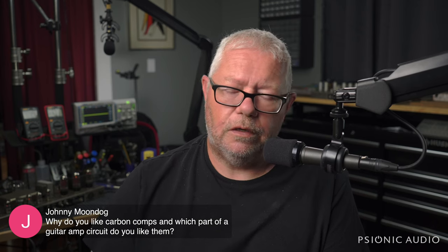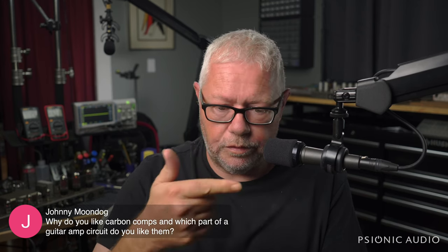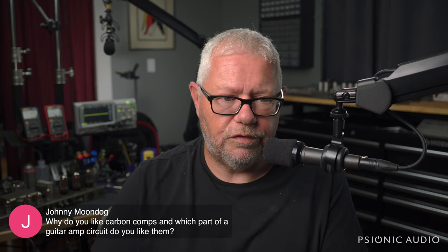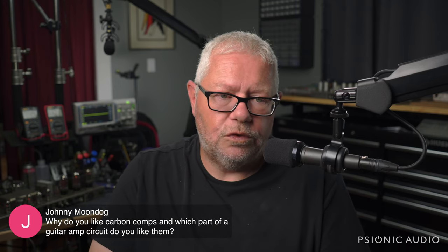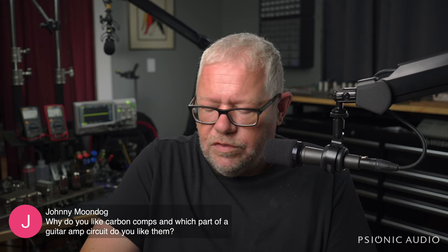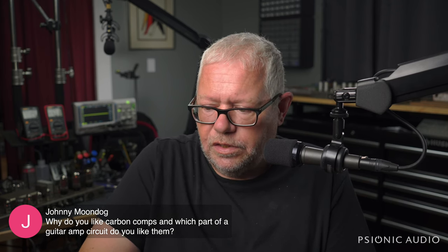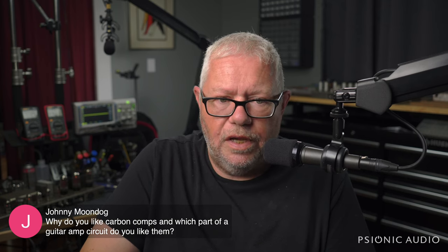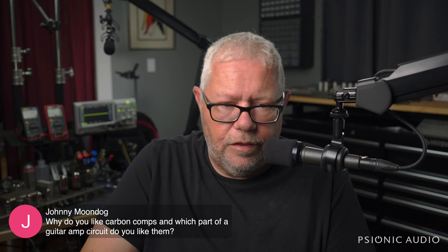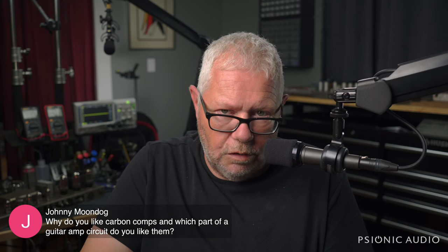It's a particular sound, and there are trade-offs to everything. I've answered this at length in other live streams, and I've addressed this in individual vintage Fender repair videos. As to which part of the circuit I like them in, I've given some specific examples, but anywhere there's a good voltage drop across the resistor and voltage is present, you're going to hear the differences more than you will in a cathode where it's like 1.2 volts, or in a grid leak where there's no voltage.